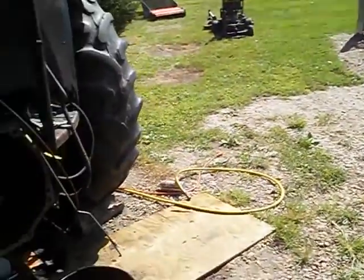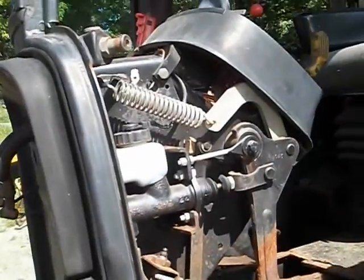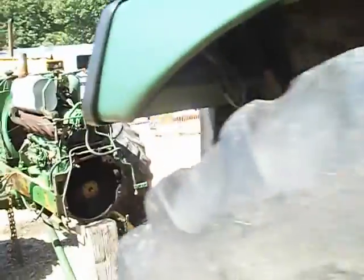In the John Deere manual, they have a specialty tool that supposedly you can get in from this access panel on the floorboard, but you have to find your way up into here. It must be a series of universals. I don't know, but I think the easiest way to do it is the two front cab mounts. Now the rear cab mounts stayed intact. I didn't touch them, but you can see they're rubber mounted, so you have quite a pivot point. You can easily get 4 to 6 inches of clearance.